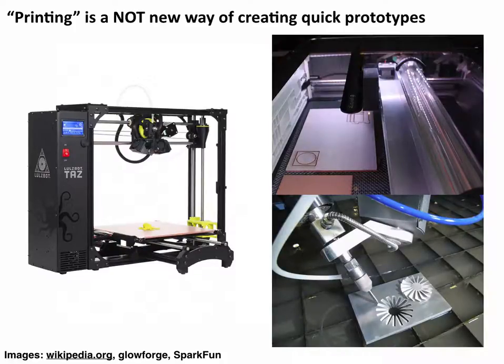There are also laser cutters, like that shown in the top right, that do 2D cutting — they're very easy to cut parts out of wood, plastic, or leather with great precision — tens of microns generally. And then there are water jets, shown in the bottom right. That's a 5-axis machine, a pretty fancy water jet. They use high-pressure water with garnet abrasive in the stream to cut straight through pretty big sections of metal.